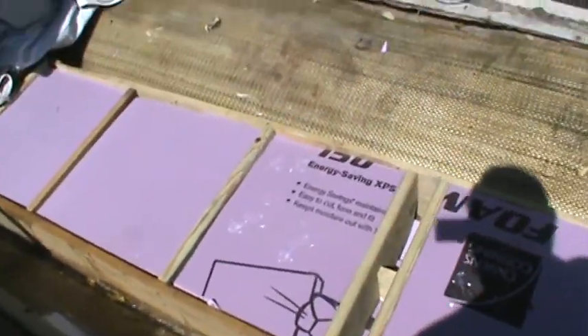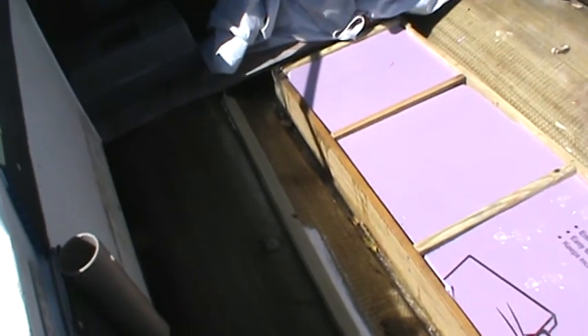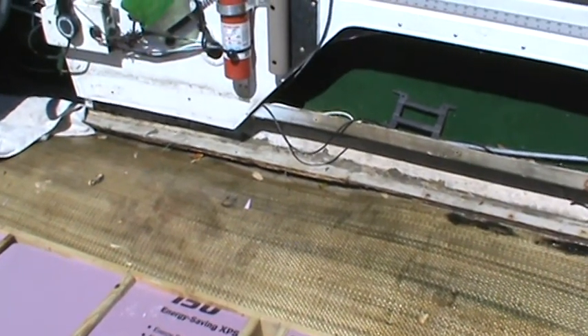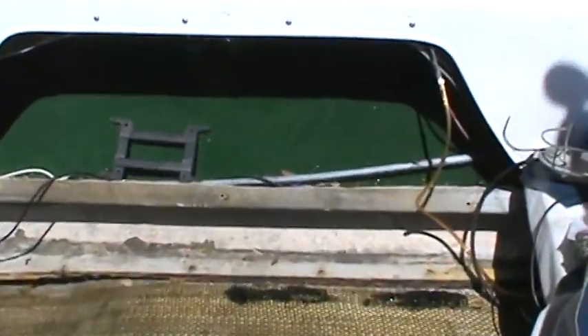I think that's what caused this boat to rot — that's what caused the full floorboard to rot out. So what I've done is put a piece of one inch by two inch treated lumber in here. I'm only going to do it in three places — where the plywood seams together with the other plywood. That way where this thing seams together I'll have something to tie to, and when someone steps on it it won't loosen or cause that seal to crack or break.